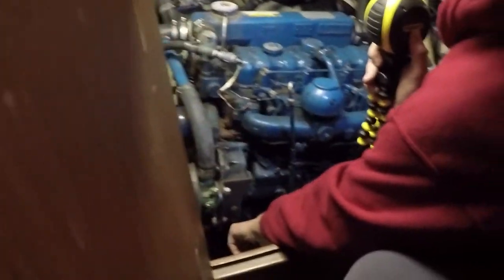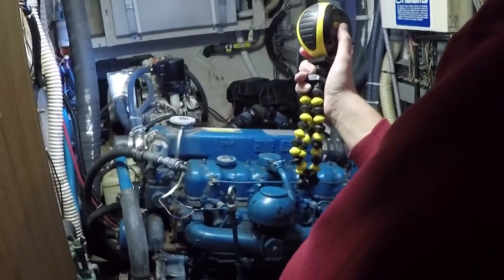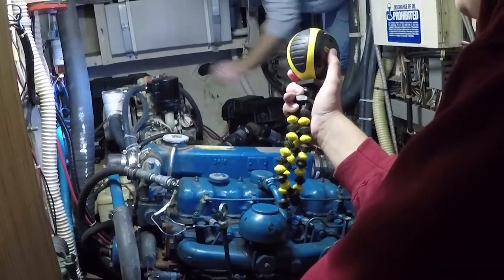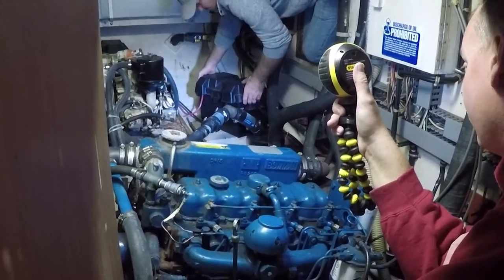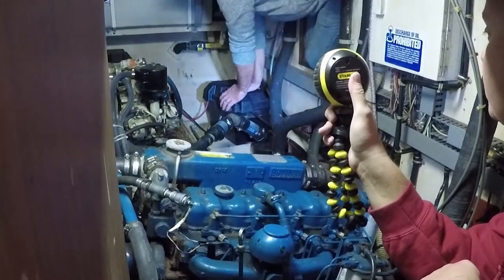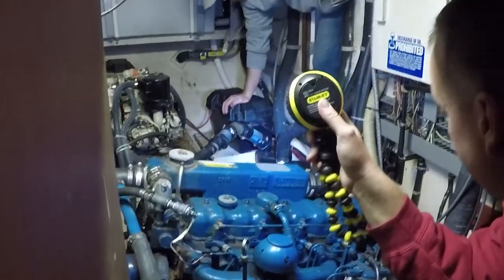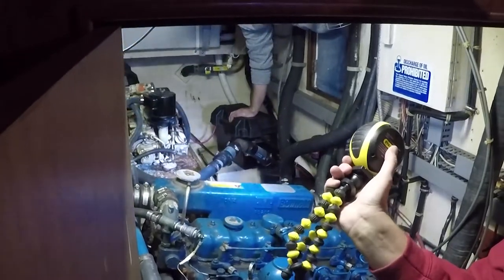That's your holding tank for your toilet. That pump right there is either your water pump for the boat or your wash down pump — either way it's a 12-volt water pump. Your battery right here — you've got to get a strap and strap that down if it's not already. The Coast Guard would have a hay day with that one. So that's your generator battery, or it might be the only battery on the boat. There's a bank of four batteries under that seat — those are your house batteries. But I think that might be your starter battery for both the engine and generator. That generator has definitely seen better days.